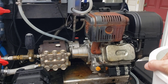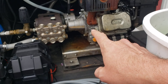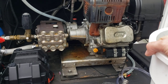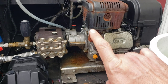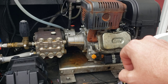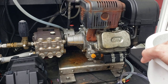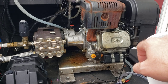It's so much easier to rinse a house with a 5 gallon a minute machine versus a 2.5 gallon a minute machine. This thing runs a 20-inch surface cleaner just fine and so far it's been pretty bulletproof — I just keep the oil topped off. The gear drive does like to leak a little bit of oil, but it's not a problem; I think it's just inherent to that design, so I simply make sure the oil is kept topped off on the gear reduction and on the pump as well.